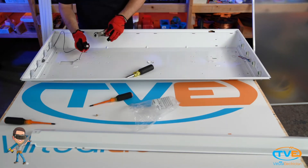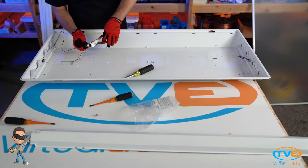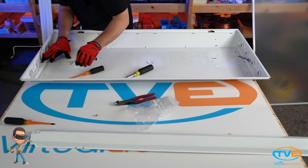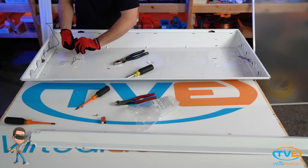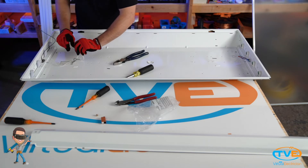After that, you screw or slide the bracket back in place. Now, you just wire all the white wires to the neutral, the black wires to the hot, and try to tuck them up there so you can squeeze that cover back on.